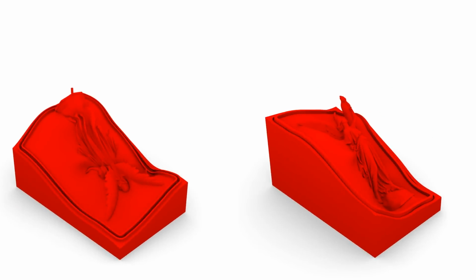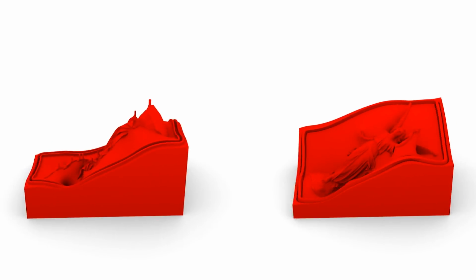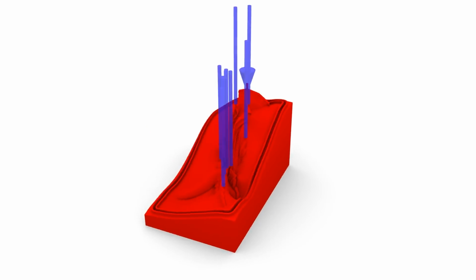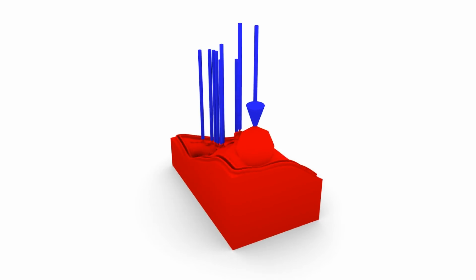Next, a metamold for each segment is designed. A metamold is a special container that is used to fabricate the final silicone mold piece. Metamolds are designed to include air pipes, which prevent air bubbles from forming during the casting process.